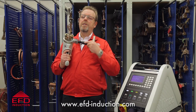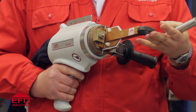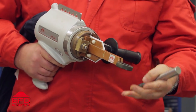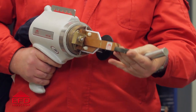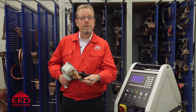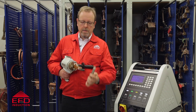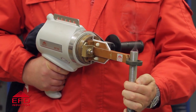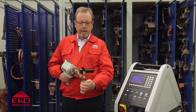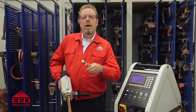I'd like to just show you a quick simple test here. This is one of our handheld transformers or HHTs and a simple single turn coil. If we run a high frequency through this coil we create a magnetic field within. If we put some electrically conductive material within that field we create eddy currents and subsequent heat. This is a non-magnetic stainless steel bar and we can very easily and very quickly heat a targeted area in a highly efficient manner.